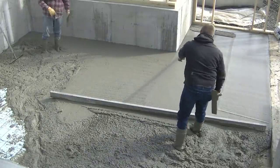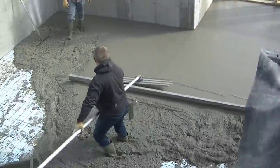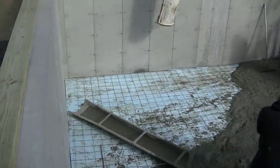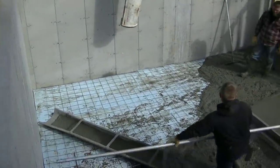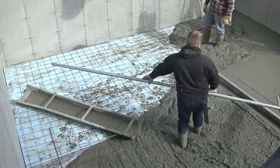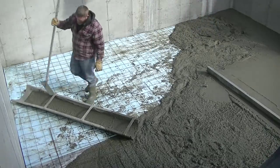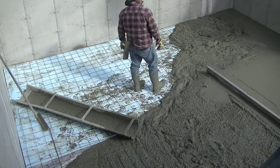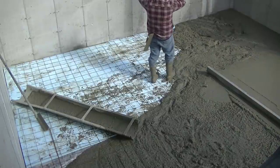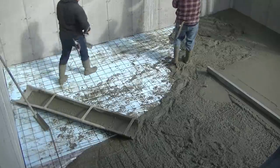I'm up getting the second truck ready, getting the first truck out of the way, backing down the second truck and getting him mixed up with bags of accelerator. You can see the chute right there — we take that last chute on the concrete truck, flip it over and hang it when we pour down inside a basement like this. It just helps make pouring easier. You can kind of direct the concrete where you want it; it doesn't have to fall quite so far. And we also use our little eight-foot chute when we need to.